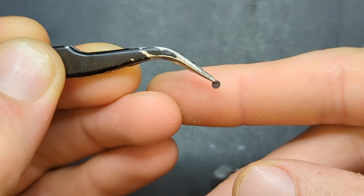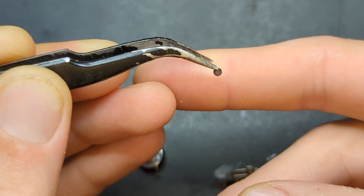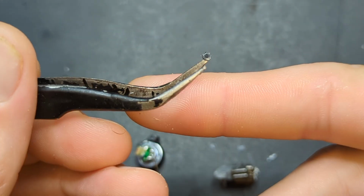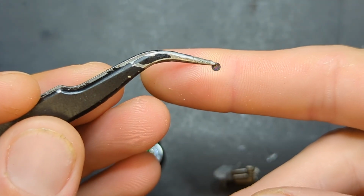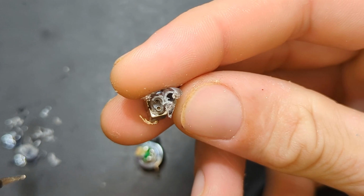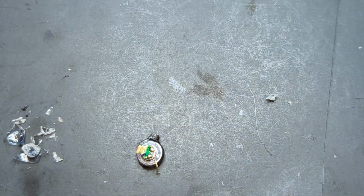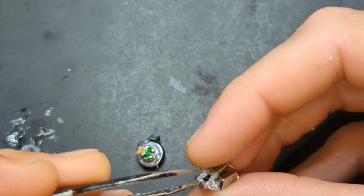So this would be like a 300, maybe 500 value. Depends on what they use. It could even be a 600, but judging by the way the light's coming through, this is most likely just a 300. But anyway, it's just a little sticker kind of dampener, and that's what they're using for the mids, it looks like. So that came out of the mid BA. So just a little bit of dampening, not much. They could be using more dampening, but that's all they're using.